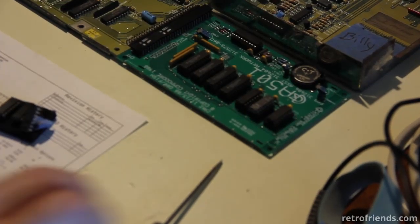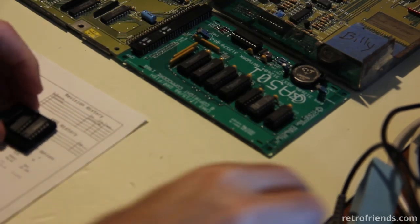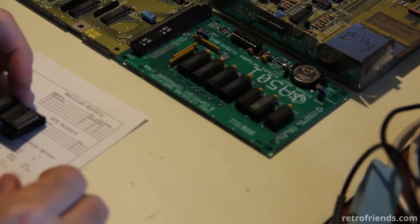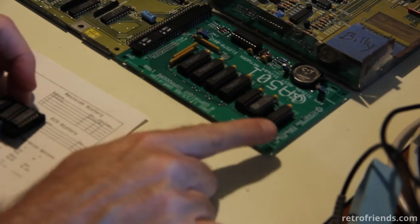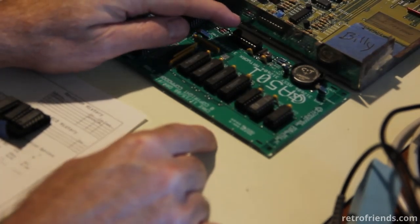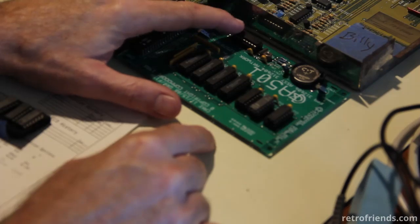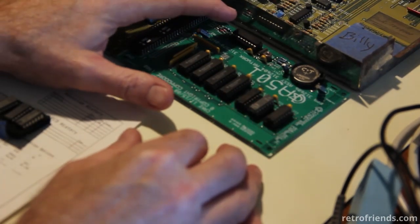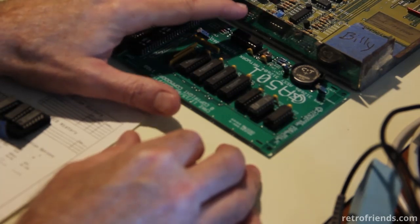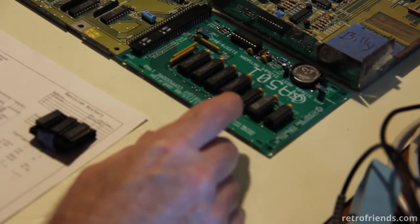Do you want to know what it turned out to be? I have a collection of logic chips that I got at some point — pretty nice to have laying around for these types of purposes. I loaded this board with three new logic chips, new old stock. Obviously the RTC chip is not something most people would keep in stock, but I actually had a bunch of those from last time. By the way, you can buy them from me — I bought like 30 of them and put a bunch up on my eBay store. Check the description. Anyway, a 74-27, a 74-86, and a 74-163.